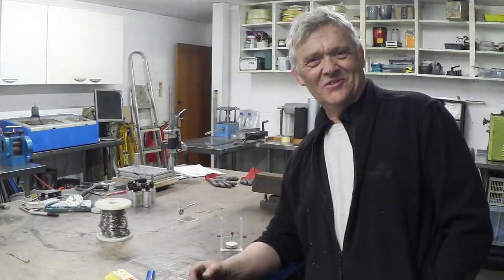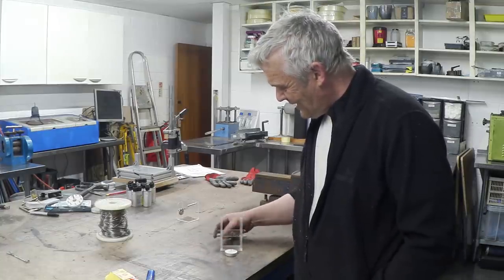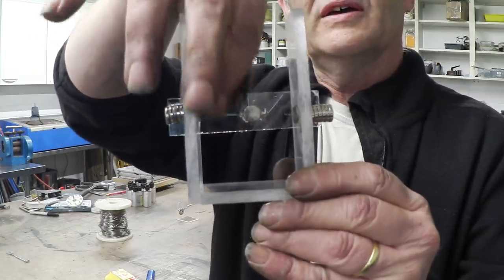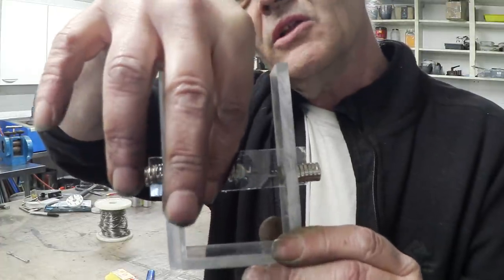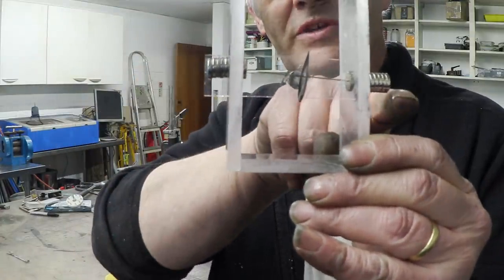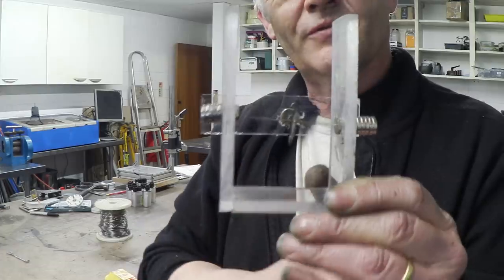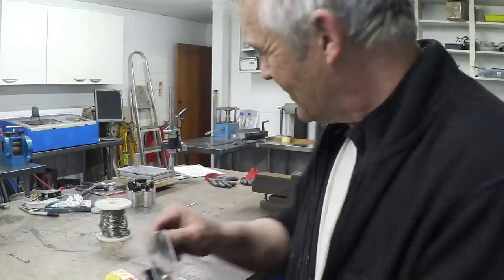Okay, those are really cool science toys, but they're just toys, eh? Actually, I just want to show you this bearing again a bit more closely, because I think it's worth having a look at. Okay. So that needle there is held by nothing. So we can pick the needle out, and it's just that magnet stack there attracts the point of the needle. And then if you see, the needle point isn't touching that magnet stack because it's slightly weaker than this magnet stack, but it is lining up that bearing. It's quite a weak bearing in terms of it can't carry much weight in that direction, but it is a very low friction bearing, and actually I like it. It's one of my favourite bearings. Anyway, I thought I'd take the time and show you that.